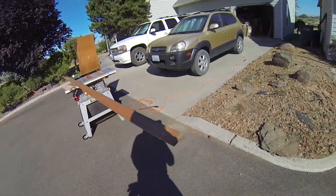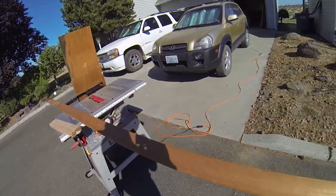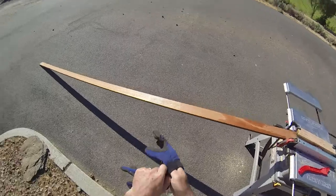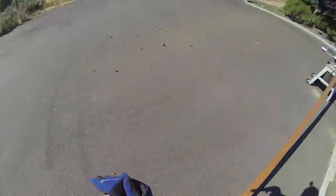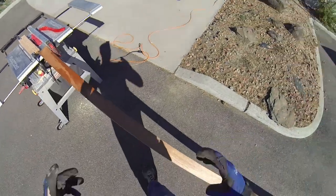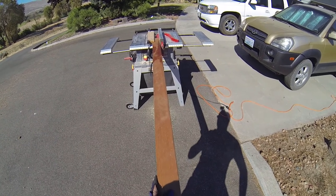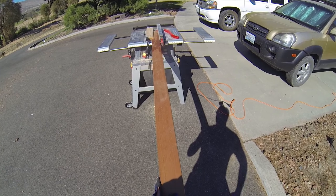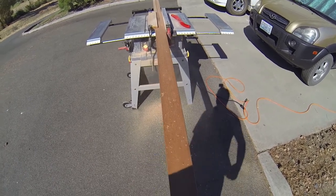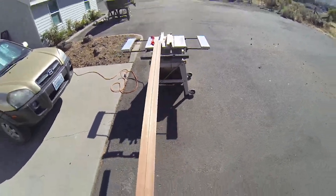Now we've got to figure out how to cut this board in half. It took a little bit of thinking to figure out how to cut this long board by myself. I took a piece of 2x4 and on the table saw cut a notch out of it so there was a lip that would hold the board from coming up, and an inset that I could set to the exact width of the board so the blade was centered. Once I got that clamped onto the table saw, it couldn't go up and down or left and right — I basically just had to feed it slowly. I pushed the piece all the way through from one end, then went to the other side and pulled it the rest of the way, cutting it right in half.